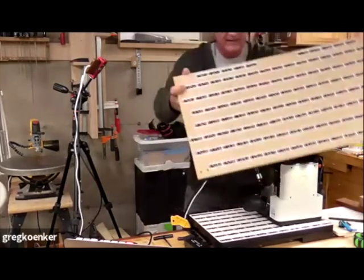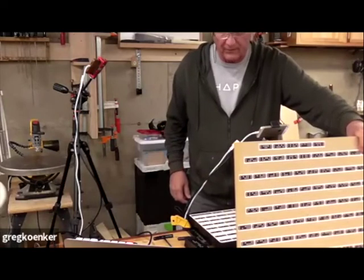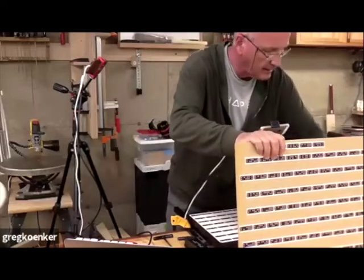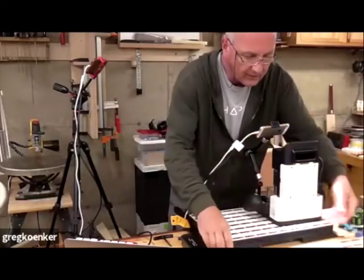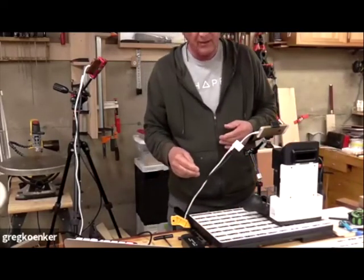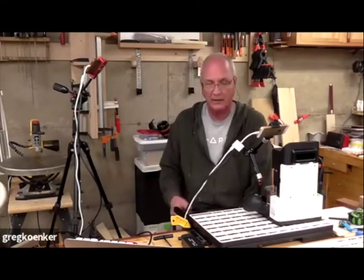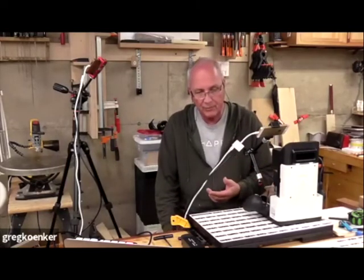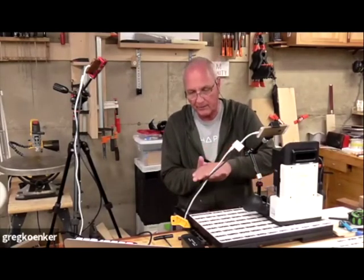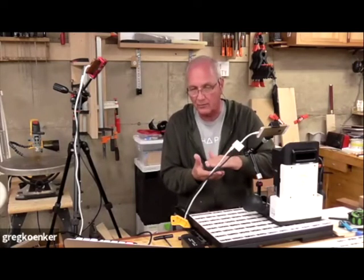Oh, wrong way. This is a tape board that I made for doing, I don't know what. I've used it a dozen times at least. And so what I can do is set it down. I can double stick it to my workbench. If I'm cutting 1/4 inch plywood, or 1/4 inch, whatever, I can put a 1/4 inch piece of MDF under it to raise my workpiece by 1/4 of an inch and give me a wasteboard under it. I can cut through it then.